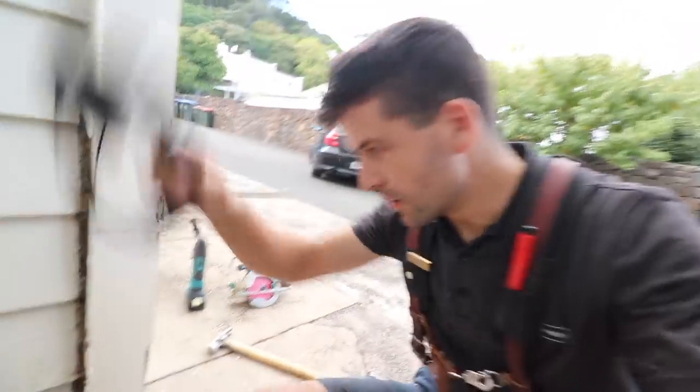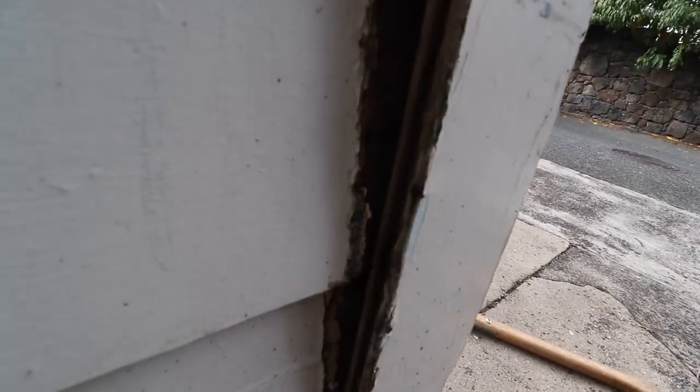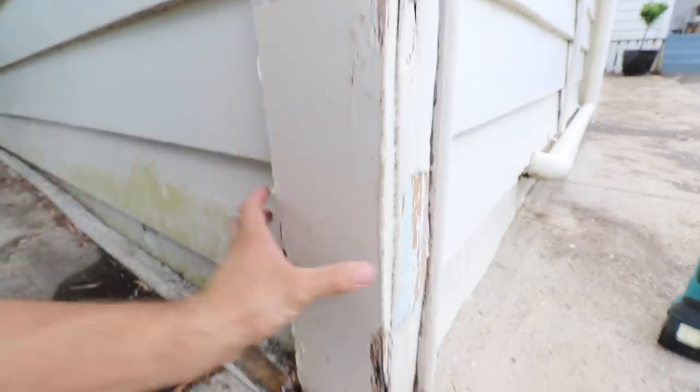Look at this beautiful box corner here. The scriber has completely disappeared and the facing itself is actually a tongue and groove floorboard, if you can believe that. That is the groove side there — probably not the worst thing to use, because the scriber rotted and disappeared but the flooring has lasted a lot longer.